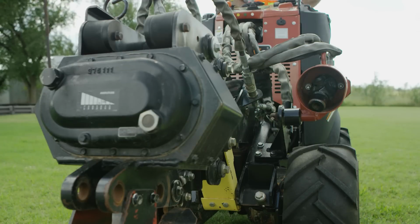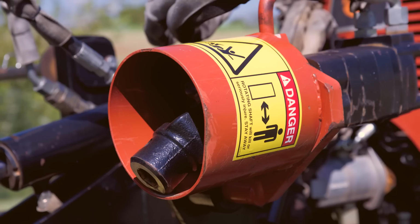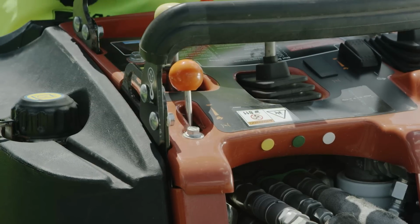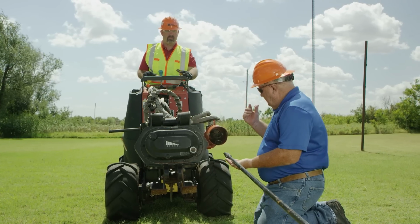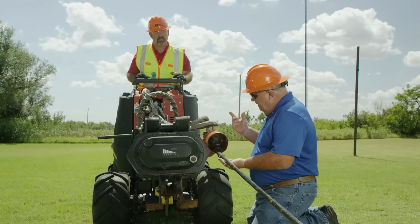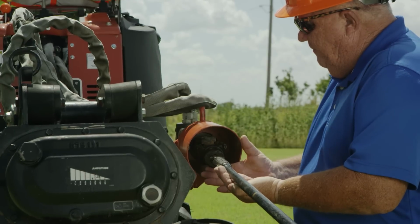If your unit comes with a roto-witch drilling attachment, keep everybody at least 10 feet away from the drill rod during operation. Before using the attachment, check to make sure the yoke guard is installed, decals are present, and the controls are functioning correctly. The roto-witch control must return to neutral when the control is released. While connecting the drill rod to the drilling attachment, have a helper lightly hold the rod with palms open and direct the unit operator to move the unit forward slowly.